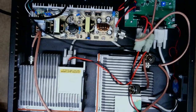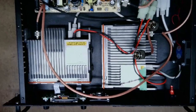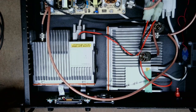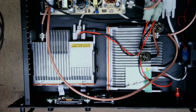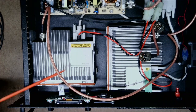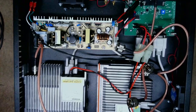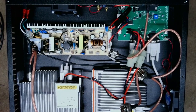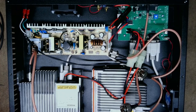The front radio appears to be the master — there's a ribbon cable running from it to the front panel of the repeater. These mobile radios have no front panels of their own. The sticker confirms 40 watts. I did push it to about 48 watts after the duplexer in testing, but again that's not recommended — the radios are only rated 40 watts and the duplexer is likely rated 40 watts as well given its size.